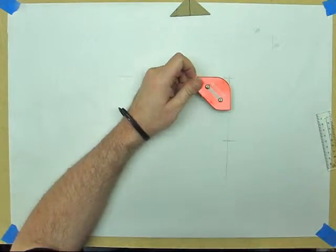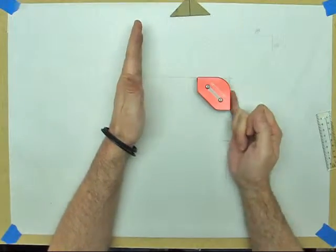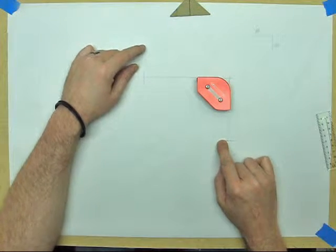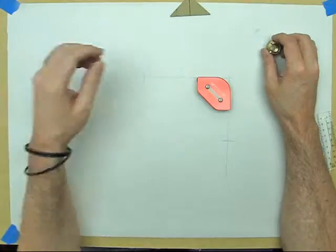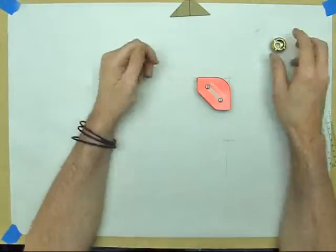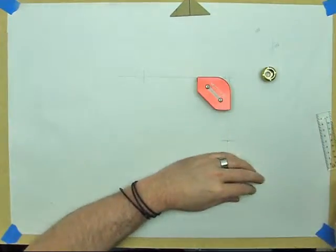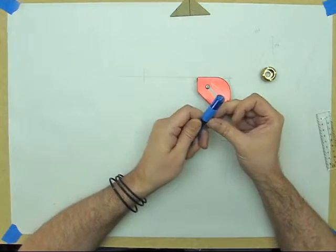Now what we've done, we've got the center line to center line dimension on both sides, and we've got our perfect length. One quick note on perfect length: the dimensions I took are with our Monsoon premium fittings, which have a flat base, so you don't have any extra calculations to do. But if you're using a push-in style fitting, one thing you will want to do, I've got a piece of tape here off of another project.